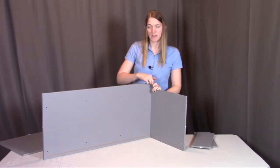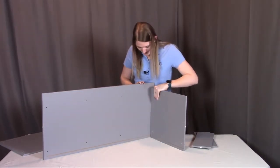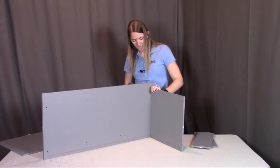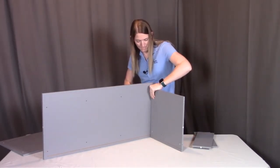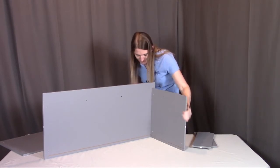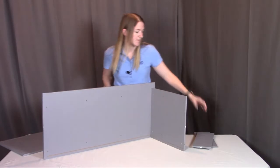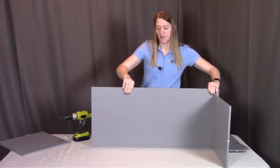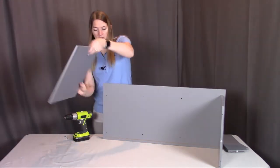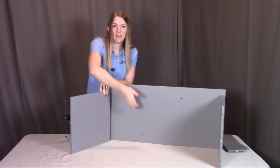When screwing from the bottom side to make these screws tight, make sure you're watching the screw and make sure that it lines up very nicely with this part for a later step. So when you're tightening the screws into place, make sure that line stays consistent. Now we're going to repeat the same thing with the other side. We're going to take part C and be going off on these two end holes here, again making sure that this screw lines up nicely with this groove, and that these two holes are closer to the side that goes onto the part A panel.